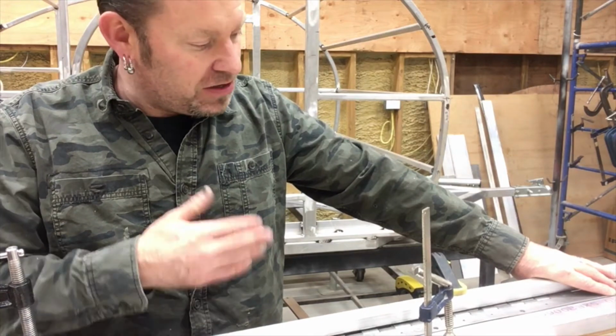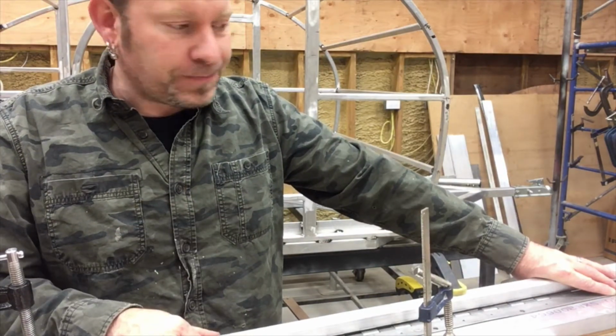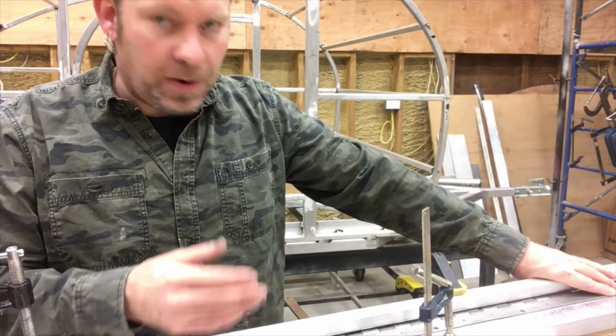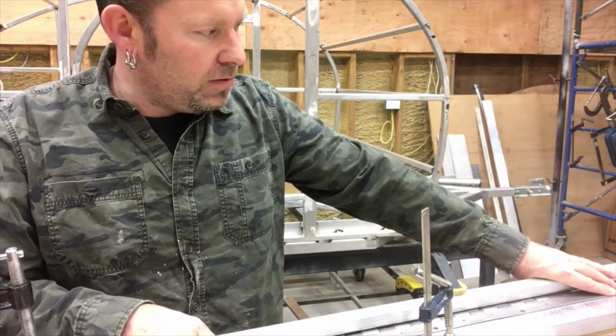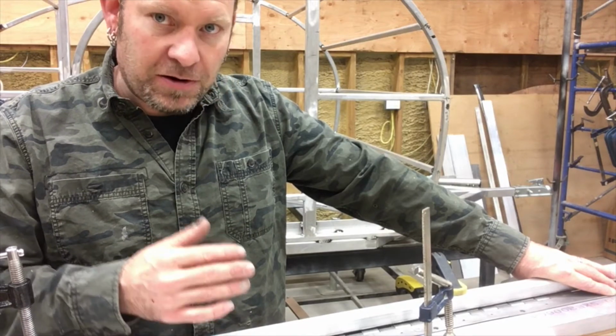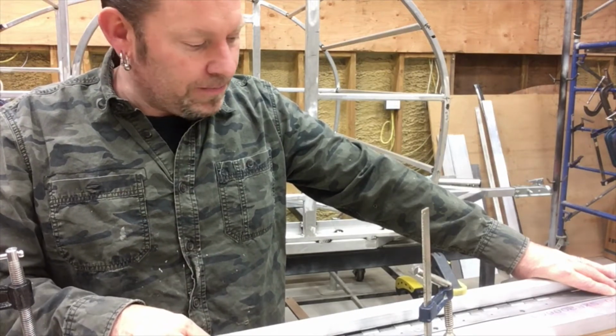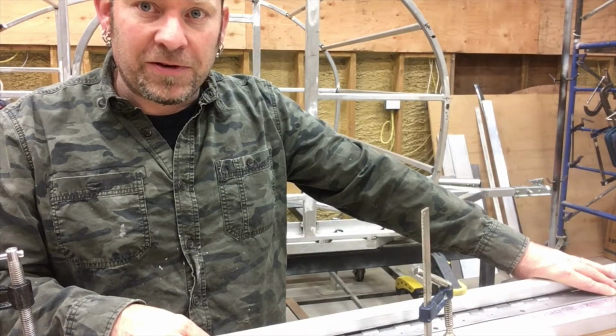So getting the measurements to get the perfect offset. At the end of the day, it has to be a 1/4 inch difference, the two bars. So I just gotta make sure I get that right across the whole hinge, but piano hinges are a little funny to measure off. So that's what I'm doing. That's the project for today. So we'll see how it goes.